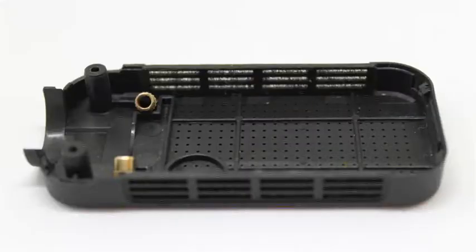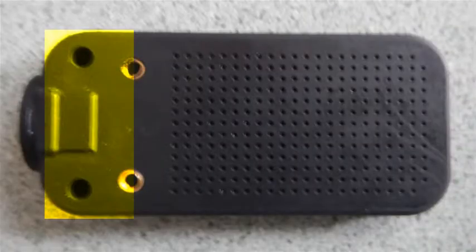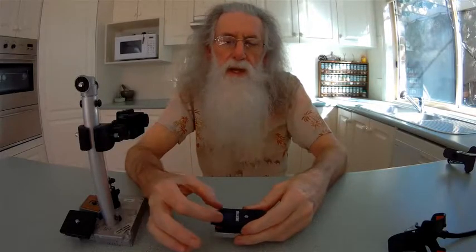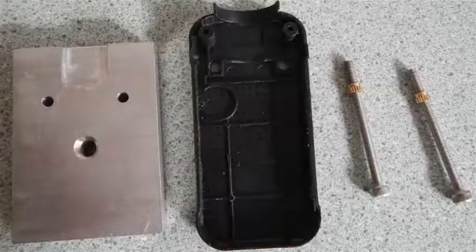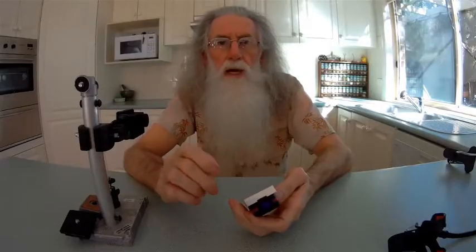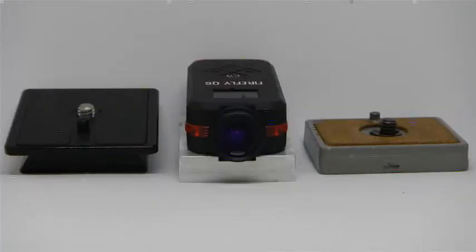I look for a suitable position to drill the mounting holes — measuring 15mm back from this face and 20mm across. You'll see where the lens mount widens out, and that gap ensures that when you put the screws in they don't hit anything. So you drill your holes in the plastic body, then get an M3 screw.